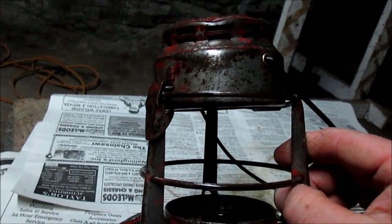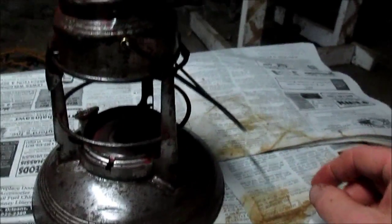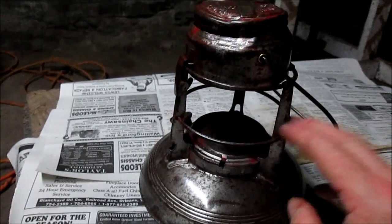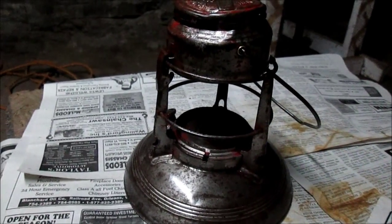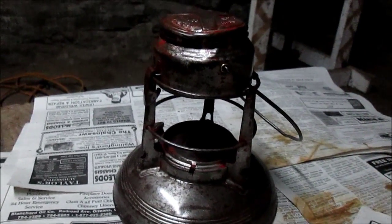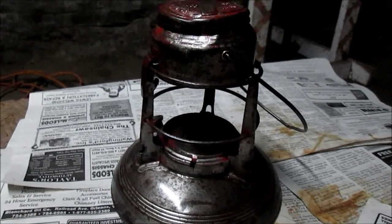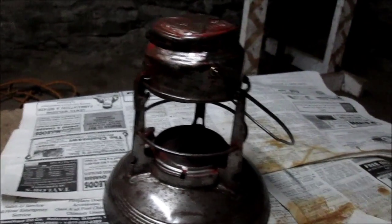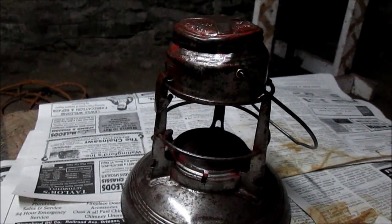This is just a pre-use preservation — I'm not going to do a full restoration on it, we're just preserving these lanterns and making them better. This one actually saw a couple of submersions in the lacquer thinner. The first time I took off a lot of paint, but what happens is when you take it out and it sets up for a little while, the paint hardens back up, so you have to re-submerge it and work it a little bit at a time to get the paint off. Most of it's off now and we're just going to wet sand it.